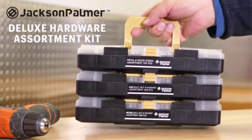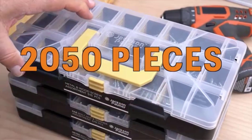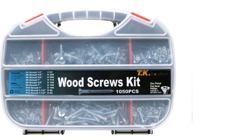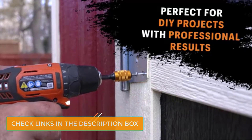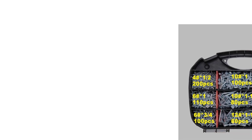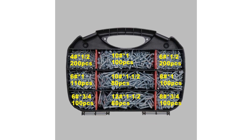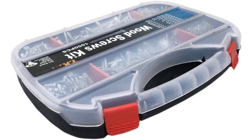Number 2: TK Excellent Phillips Flat Head Wood Screws Kit. If you need a fantastic selection of flat-head countersunk screws for different uses around your home and on the project, these screws could fit the bill. For example, if you reinstalled a door and two of the four screws no longer hold the hinge in place, you need a variety of flat-head countersunk screws but aren't sure what size. This assortment caters to every need for home improvement and wood fence projects. Note that these are soft screws — drill pilot holes before screwing them in to avoid stripping the heads.